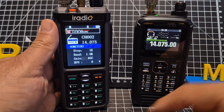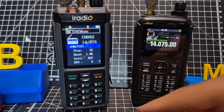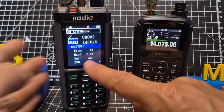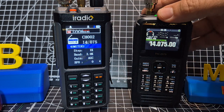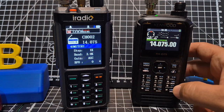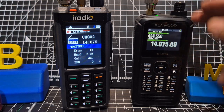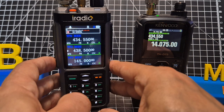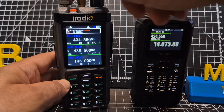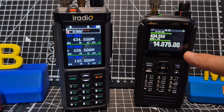You can also interface the radio with your PC. I've got a feeling you can interface this one with your PC in certain modes — possibly GPS and APRS type stuff, but that's just a feeling. Both of these do have Bluetooth, though this isn't the Bluetooth GPS APRS model. There's an APRS TNC on here. Going to dual receive — and with the latest firmware, on the A band. So we've got triple display on the iRadio and dual display on the Kenwood.